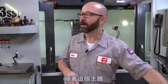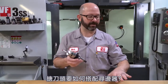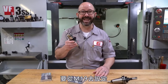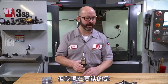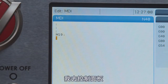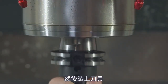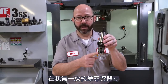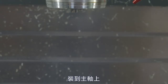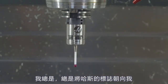Along those same lines, I want to talk about our probe. What does a boring bar have to do with our probe? It's that M19 — it's that M19 when the tool is loaded that I want to talk about. Before I load a boring bar, I go into MDI, I enter M19 and press cycle start, and I watch the spindle orient. Then I load my tool. Before I calibrate my probe for the first time, I use MDI, I press M19, I watch orient, and I load the probe into the spindle — and I always, always load it with the Haas logo towards me, towards the operator.